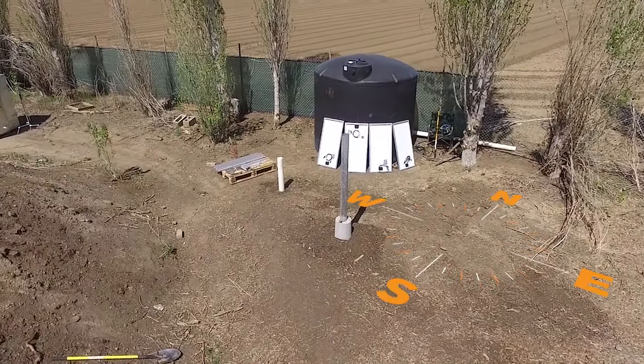We've gone ahead and dropped our pump — it's down at the bottom of the well. Now we don't want to leave it at the very bottom. We're going to raise it around five feet off the bottom, even more if you have plenty of water in your water column. That's going to allow any sand, silt, or other debris to settle down below your pump so you're not constantly sucking it up and possibly wearing out your pump or putting debris into your water supply. Since we know we're at 65 feet, I went down to the bottom and I'm going to pull it up five feet to set it at 60 feet, then cut the poly pipe off and install our well seal.